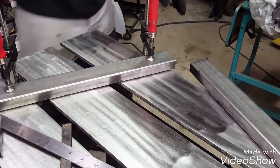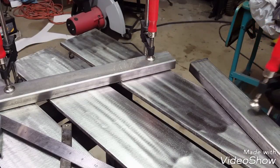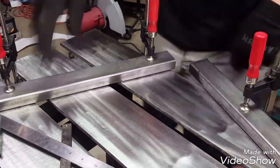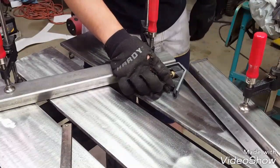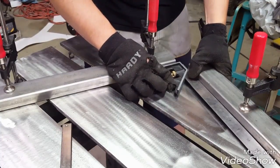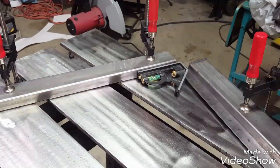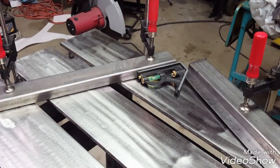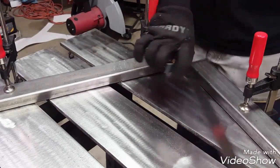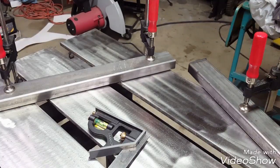Here's a quick fixture that I use a lot — this is just a 90 degree fixture; you can do any angle with these. All I'm going to do is clamp one side completely down and then one side just at one end. Then you just smack it around until it's nice and square and clamp it down. See how I left the little open base right here? That's so when I put two pieces of metal in here, I can tack the outside corners and it won't get on my table.